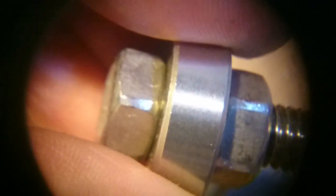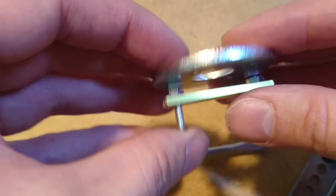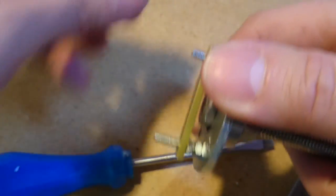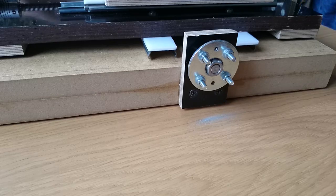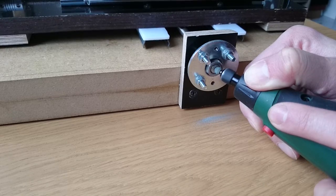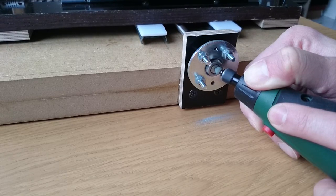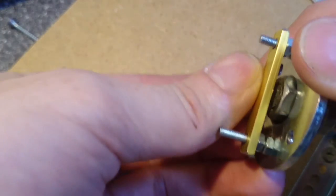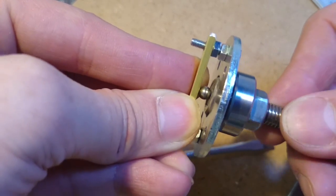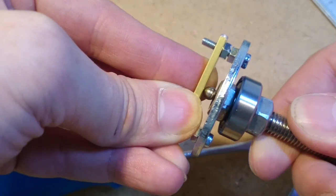When I took a very close look at one of my ball bearings, I realized that they move sideways a tiny bit. This might turn into a precision problem for my machine. As a solution, each axle will get a steel ball assembly as stabilizer. For that, I am grinding a little dimple into the top of the axle. A steel ball is positioned at this place and pressed firmly a little bit against the axle. This will keep it from moving back and forth — so I hope.